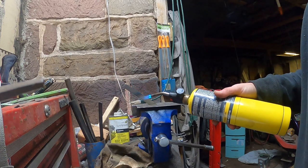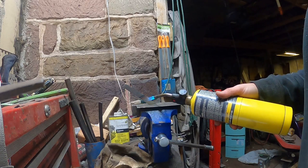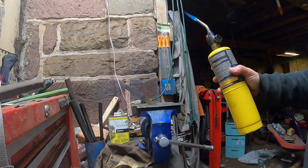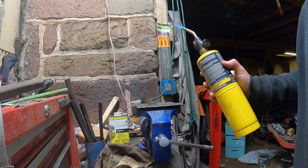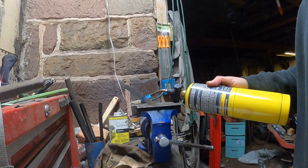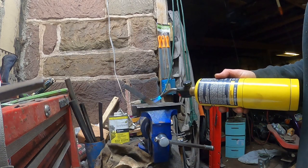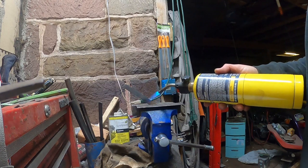That would be when I tried to do a center punch to get ready to drill this one. This one actually also cracked, as well as the other one. So I should be able to actually lift this up, and it should fade its way down now. It's not, so we're just going to have to bring it a little bit further ourselves. So we're bringing this straw color down towards the base here, which is bringing the rest of the colors down and in.